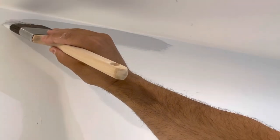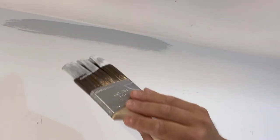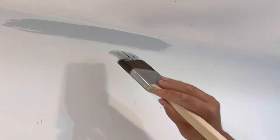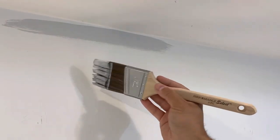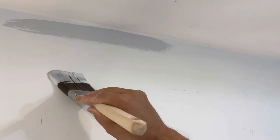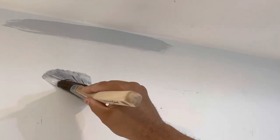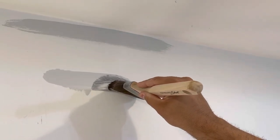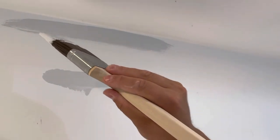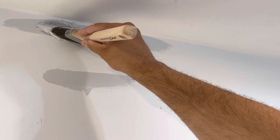What we want to do is start far from the ceiling, then work our way up to touch right at the corner of the ceiling, letting just the top few bristles brush across that corner — not the whole brush. When you press the brush up against the wall, the bristles spread upward and fan out, giving you a nice fan of bristles. I'm going to get just a touch more paint and slowly fan it out, working my way up to get as close as I feel comfortable to the ceiling edge.